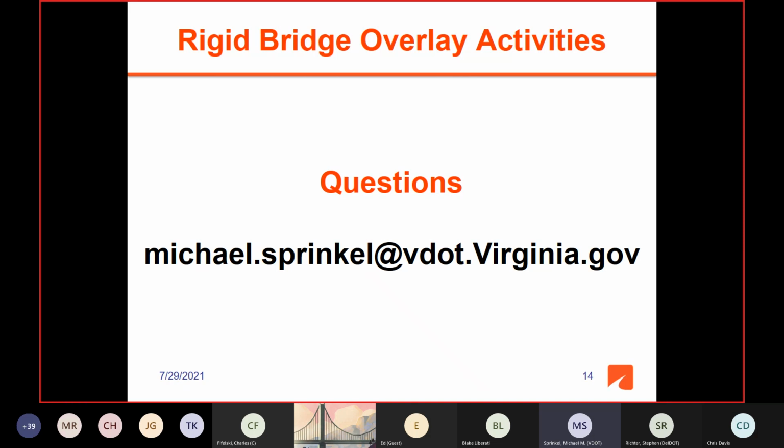So I published a TRB paper that shows that over time you will meet the spec with latex modified concrete. Sometimes you have to wait, but the good news is it continues to get better and better.